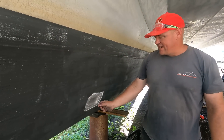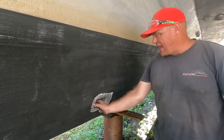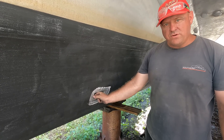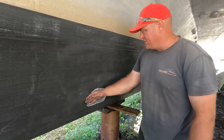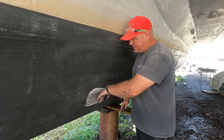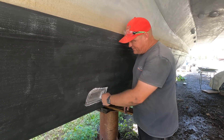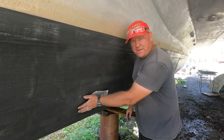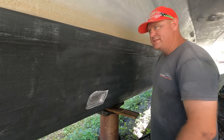Where our recessed anodes are, we're going to put a hard edge - we'll fare this edge here and fare the inside and make a hard corner. That will break the water away so we can have a back eddy in the front, and we'll smooth off the other side and the edges with a little bit of fairing to make it nice and smooth and slippery.